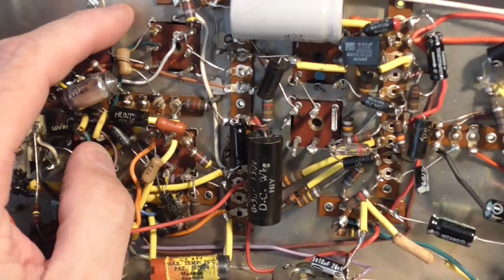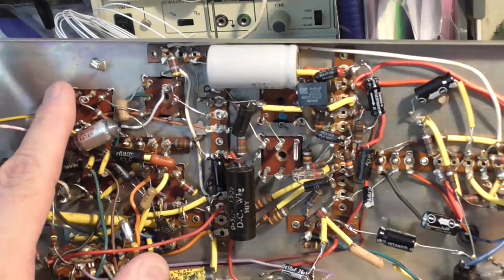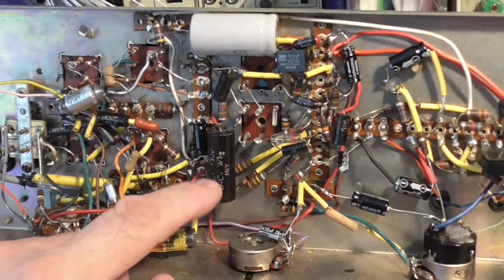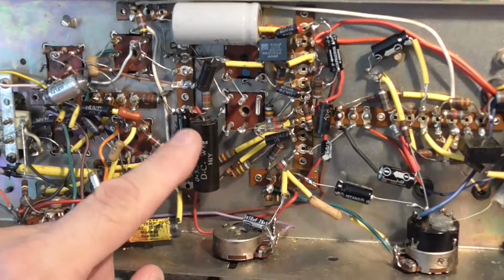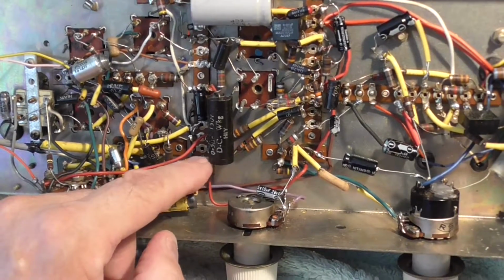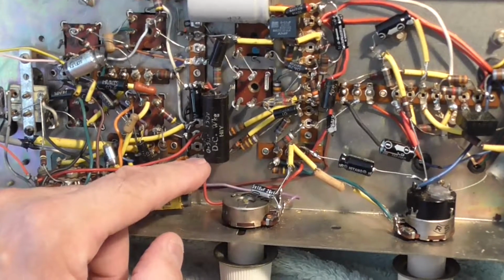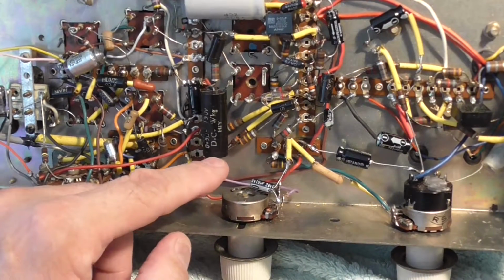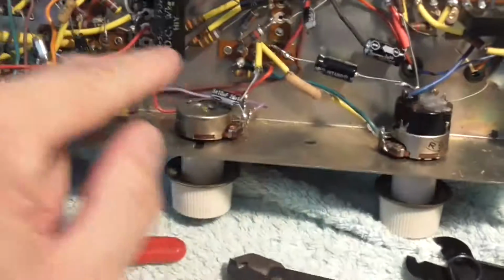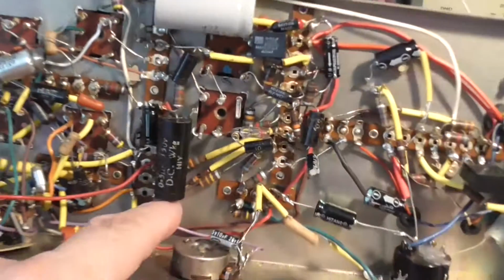It looks like they've bought some good parts on them IF cans. They look like good ones, but I'm not so keen on these Hunt's capacitors, mind. They don't look very good to me. I would imagine back in those days they'd be buying their components in quite large quantities, and when they suddenly stop using them for the mains radios or whatever, they start trying to use up the parts on other things. This big capacitor here is rated at 150 volts.